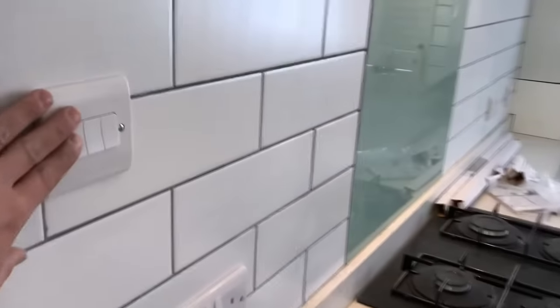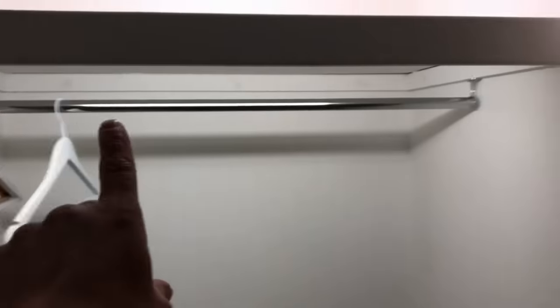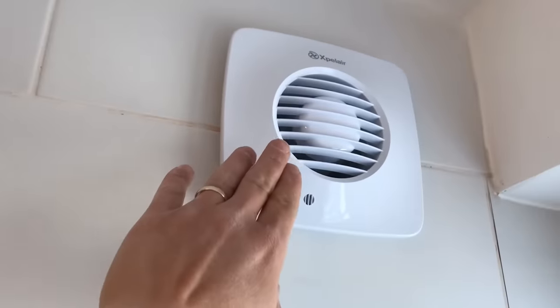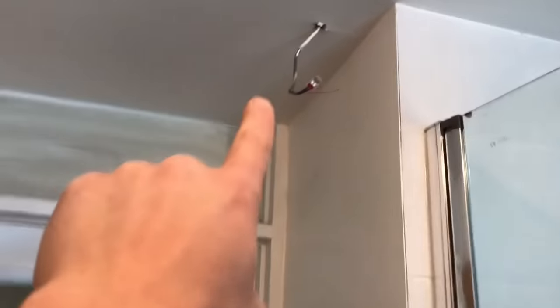Right, as you can see I've got my lighting now. Switches separately on the lights. Smoke alarm's all second fixed. Lighting's all done. And then my little lighting in this cupboard — as soon as you open the door, you come in for your coat, light comes on. Which is a nice little feature. And then in the bedroom it's just got one pendant, and as soon as you open the door into the wardrobe, light picks you up and you've got the little LED under there and the LED above. That's a nice little feature again. Extractor fan is done — I like these Xpelair ones, you can't even hear it running, very silent. The light is done. I can't find the pull cord so at the minute it's in a way-go — I'm going to have to go off and get a pull cord.